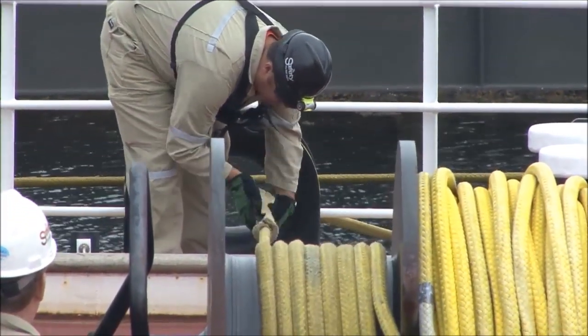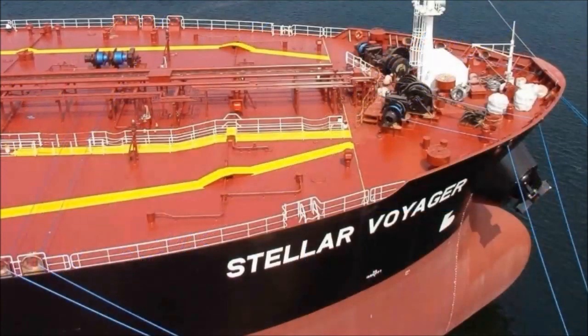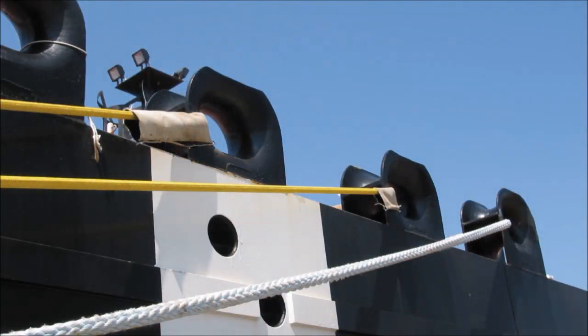The sliding type is appropriate if you've got a mooring rope that will deploy back and forth. Mooring ropes are generally 200 to 220 meters long, and you never know at what height the ship will be in the water column — ships take product to one place, then another, and then offload, so they move up and down in the water column. The sliding chafe placement is very common so that the rope can deploy down and just slide through the chafe protection. The crew can move it, or in many cases it'll slide on its own because, for example, our Amsteel Blue is so slippery it just slides down as they adjust those levels.